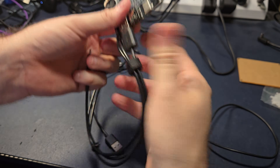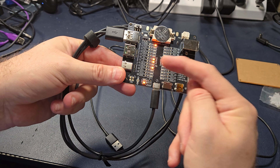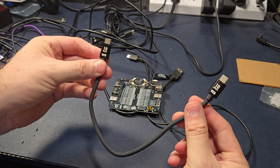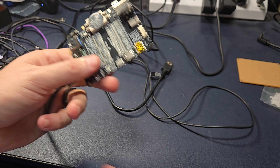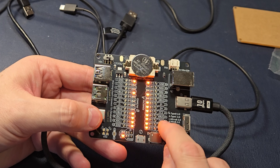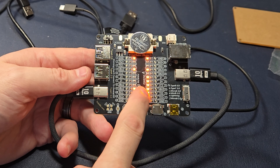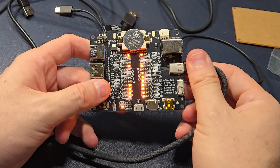Okay, I knew I had one around here somewhere. This one I happen to know is a 60-watt, 10 gigabits per second cable — so this should be the mother load. Let's see what it says about this guy. We got a little bit of everything in here. We got our CC, we got our data, we got our transmission, we got ground, we got V bus. This reconfirms that the CC means we can put some serious juice through here. We've got basic power and TX transmission — and we've got RX over here, TX over there. This is like the greatest cable ever.